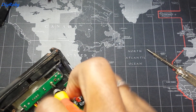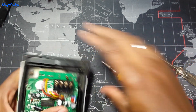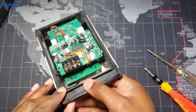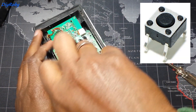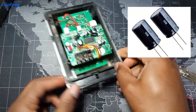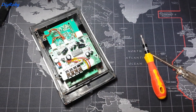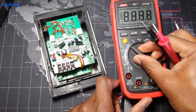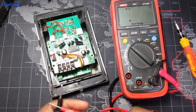The first thing that comes to my mind when looking at something like this — especially given that it doesn't ring inside — is to check the push switch. I've opened it and inspected the capacitors. Whenever you have capacitors inside something that's claimed to be water damaged, you should look at them. Generally those capacitors go very quickly and swell up, but these look fine.